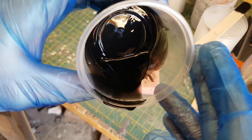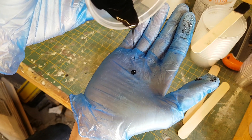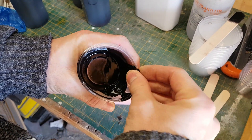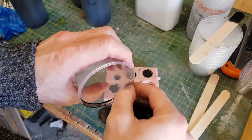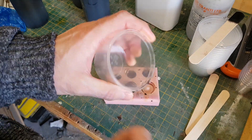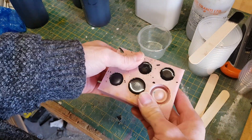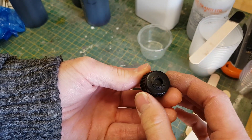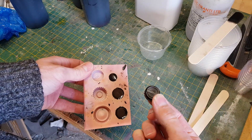As you can see the resin is flowing quite freely in the mixing cup right now, but after about a minute it slowly begins to slow down. At this stage it's getting really sluggish — it's about to set. I've left it for about ten minutes, come back, and as you can see the cured resin pulls out of the mixing cup quite nicely. The way polyurethane resin works when setting is it gets quite hot, and the hotter it gets the quicker it cures. This is true of polyester resin too — both have an exothermic reaction, giving off heat as they cure. For larger pieces they can sometimes be too hot to comfortably rest your hand on, so don't be alarmed.